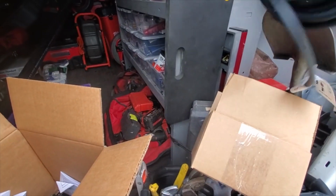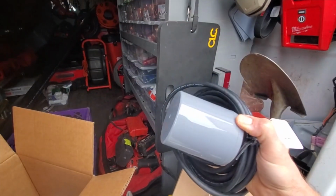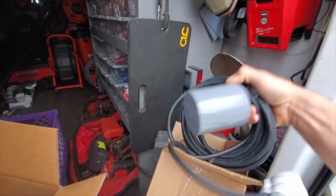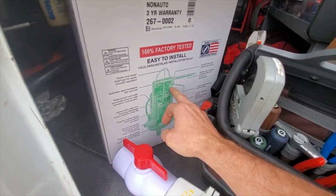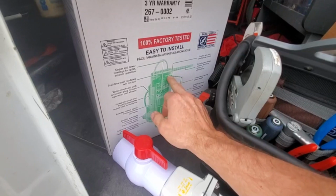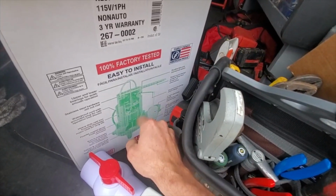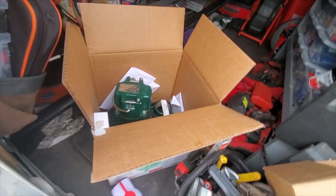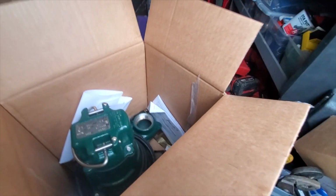this type of pump, tether pump, where the water fills and then this floats up, and then there's a mechanism, there's literally a ball bearing inside that you can hear. It turns the pump on. So the reason we went with non-automatic is these tend to have more failure points. And I've seen these break all the time, the little arms right here. But these have more failure points. The guy was explaining some other things as to why the non-automatic really are your better option for sewage pumps. Those people, they don't do anything but pumps, and they really knew what they were talking about.